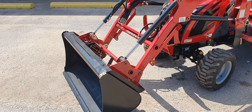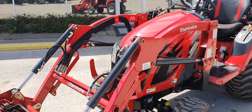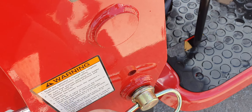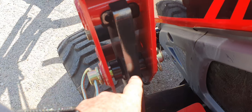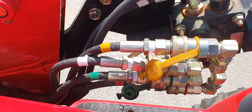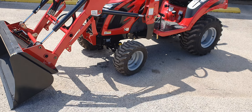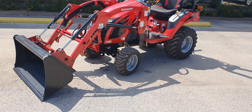Skids to your attachment bucket, so you can put pallet forks or anything else on, or you can remove the loader if need be. You do have two kickstands — you have one right here, then you have one right there while it's in the air. Then you pull the pins because they're just sitting right inside of this cradle. You can see the pin system right here, so it's easy to remove. And then you've got color-coded hydraulic lines on the other side to remove the loader, just in case you don't need that extra weight on there.